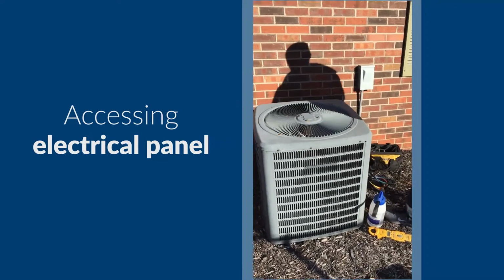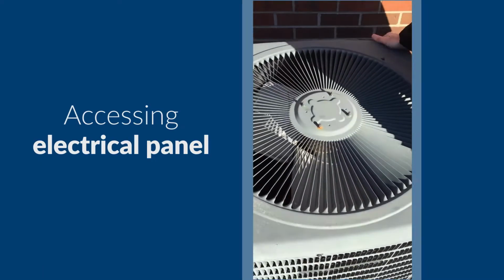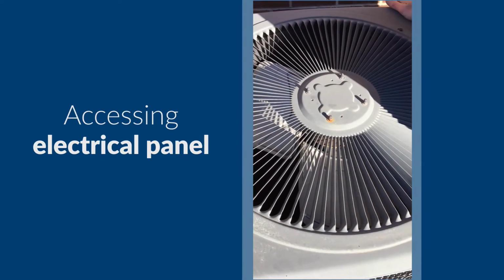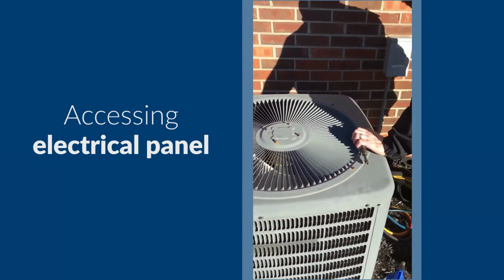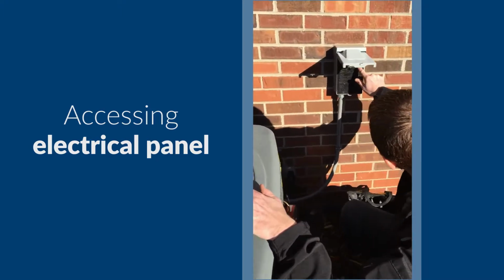Verified that the filter's clean, blower motor is running. We do have a call for cooling. The outdoor unit is not running. The fan is not spinning. So I'm going to verify that the disconnect is in and in the on position.